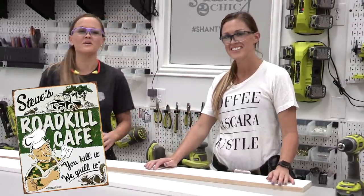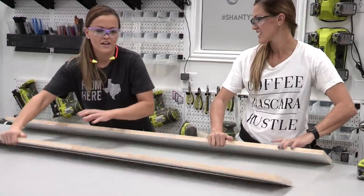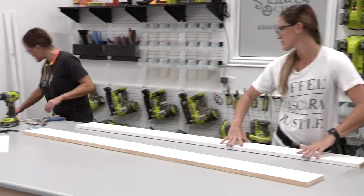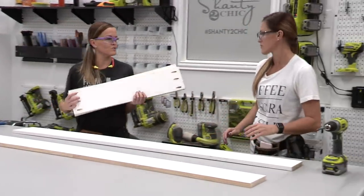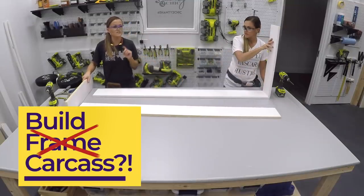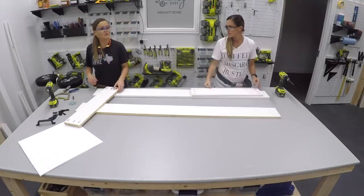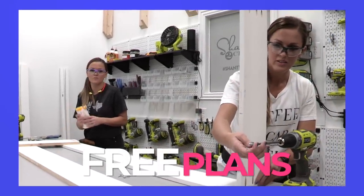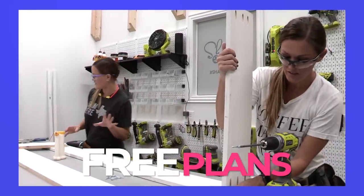Because we're kind of building a frame for the carcass. We're going to build the carcass — she loves that word. These are one-by-six boards, and they are going to be the sides, and we are attaching the end boards using pocket hole screws — one and a quarter inch pocket hole screws — with glue. Don't forget that. We will be linking to the plans from our website in the description box, so you can get all the cuts and everything that you need.